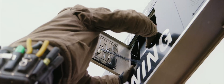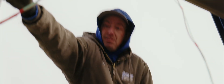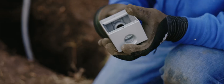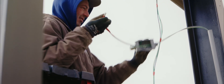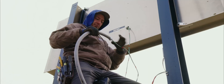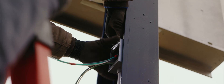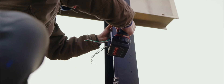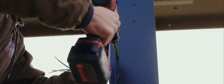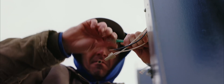Now that the wire's pulled in — and that only added about one hour — remember, if it takes 30 minutes and you lost 30 minutes of production, that's an hour of added time. We installed the J-box up high for a couple of reasons: one, we don't want any non-professionals messing with this; two, we didn't want a long loop of liquid tight from the box to the scoreboard. Of course I brought the wrong size liquid tight, so I had to open up the scoreboard and swap the initial connector with the correct one.